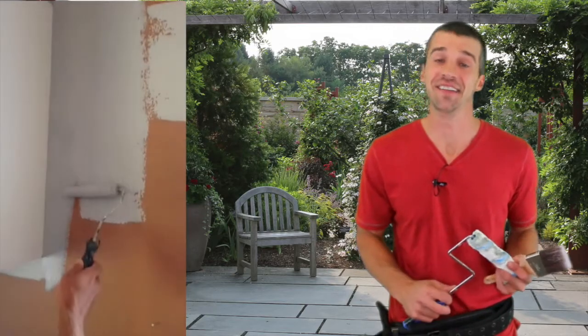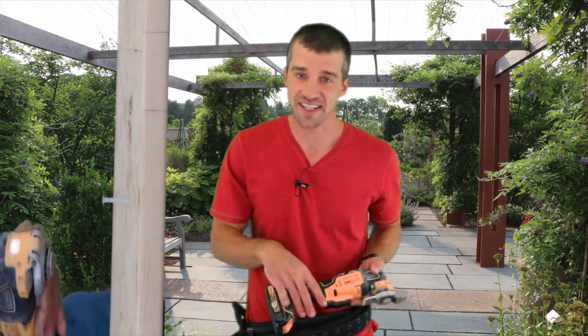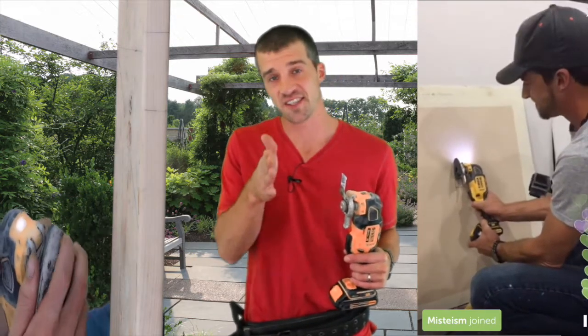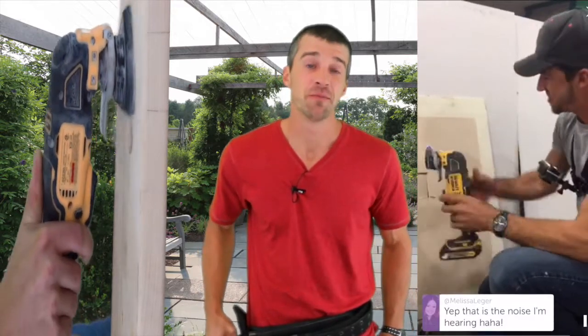Number twelve is a multi-tool. These are fairly new to the market — about five years old — but I've used them a lot on remodeling projects. The multi-tool has an oscillating head that vibrates back and forth to create a cutting action. You can swap out the heads for a sander or a wider cutting head. They're great for cutting the bottom of doorways for new flooring, putting in outlets with fine precision cuts, and sanding. They're also cordless and lightweight.